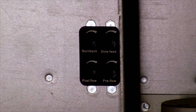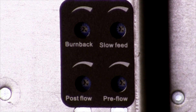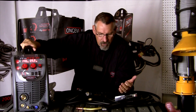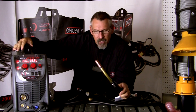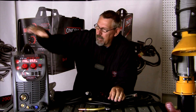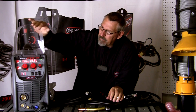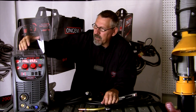There's a little feature for TIG and MIG: there's a pre-flow and post-flow for your TIG welding gas, and a burn back setting, low and high, to burn back the wire at the end of the MIG weld. It comes with what you need to get started — MIG welding with a spool of wire inside, and you can be MIG welding right out of the box in a few minutes. Some electrodes and it can be stick welding. Easy to operate, simple control system, not too complex.